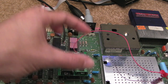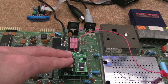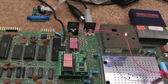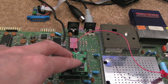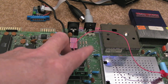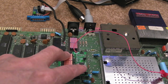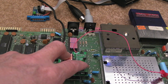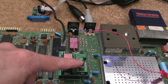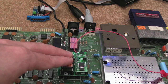In summary: if you run a Nano SwingSID on its own you're going to have that issue — a capacitor on there is not going to fix it. But on a dual SID board, potentially with a capacitor — depending on the revision of the SwingSID you've got — anything from 2.2 to 10 picofarad on the chip select pin should solve the issue. If you don't have an issue, when it's in slot two it will sound perfect. I'll demonstrate that now — I'll play Alien with both SIDs connected but route the audio from the Nano so you can hear it, then I'll remove the first SID and you'll hear SID 2 revert to its original problem. That to me is strong evidence the problem is related to its inability to respond to reads.